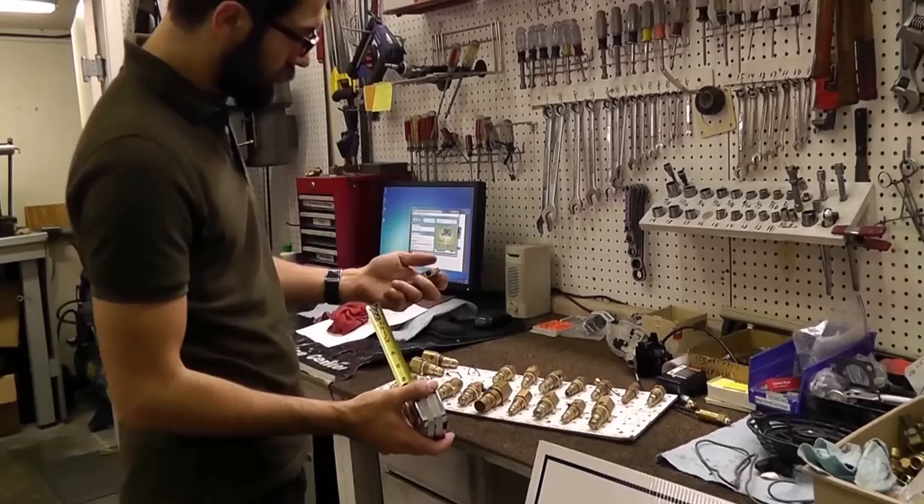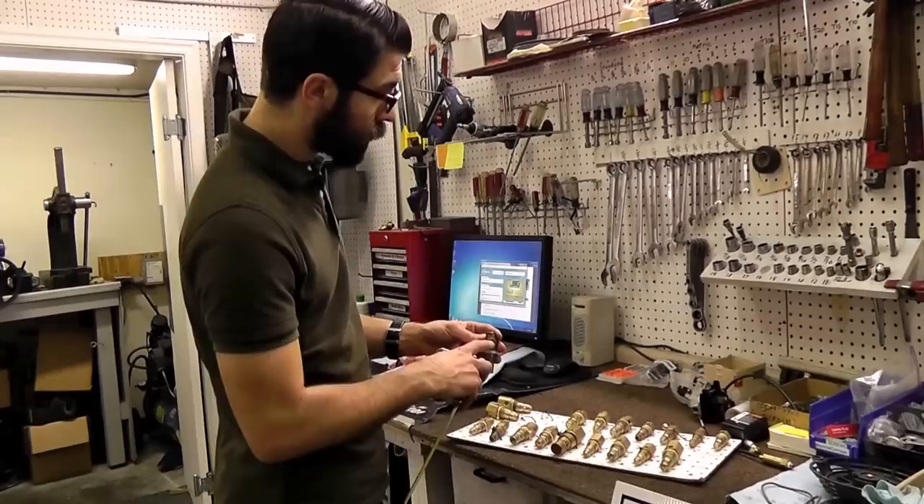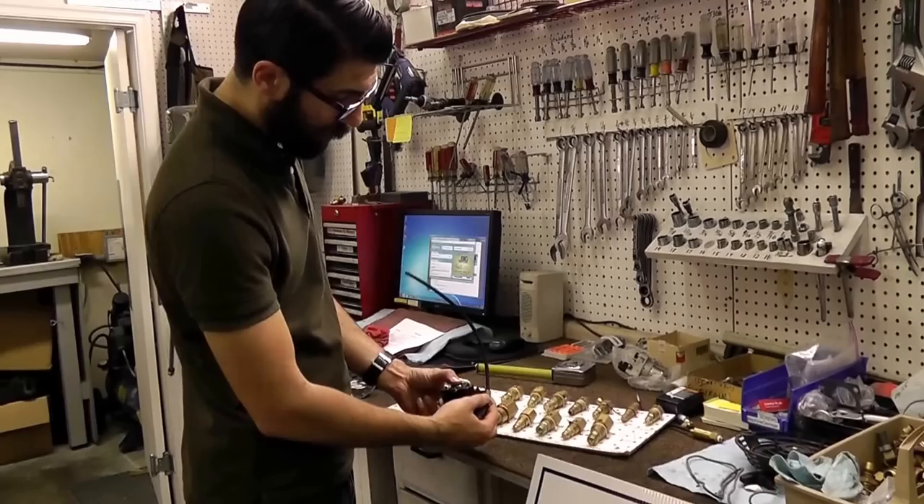There's also an accessory port here — a 1/8 inch port — for the unloader tube to attach from a pressure switch. This unloads the compressor after it shuts off. The unloader tube routes via a standard compression adapter to this port. You might have a plug here; if you have an unloader tube you'll want to use it, otherwise just plug it up with a pipe plug.